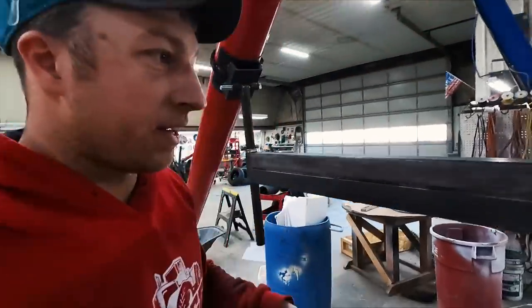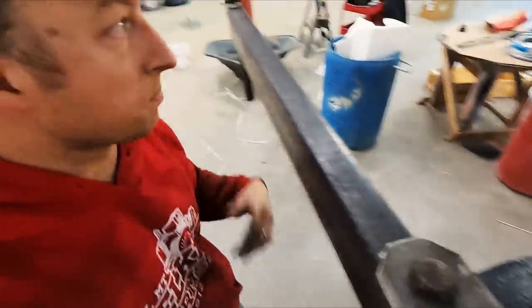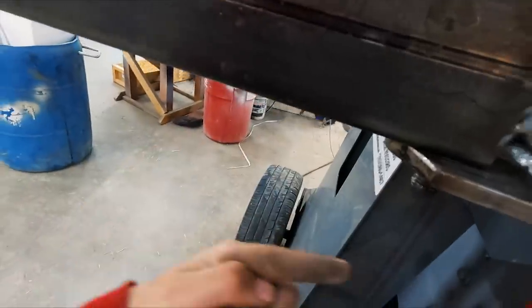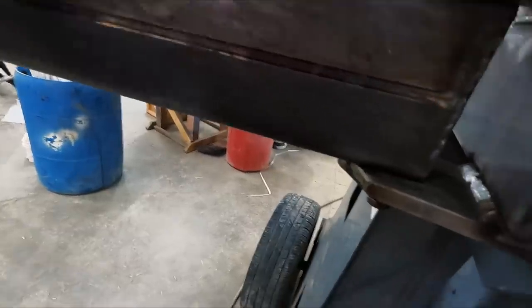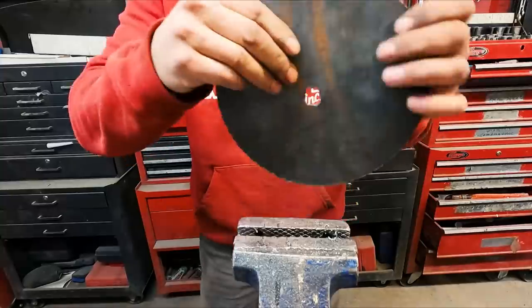Well, our idea to that is to put some type of pin system right here on this arm so you can latch it, put a pin in different positions depending on where your auger's at. Well, I found this in our scrap pile, and there'll be little holes drilled all around in a perfect half circle or whatever arc, and you'll be able to take the pin and pick which position you want this arm to be in and pin it, and that way this can't drift back and forth while you're cleaning. Make sense? Let's make it.